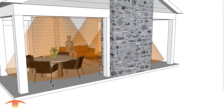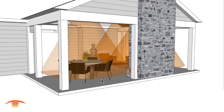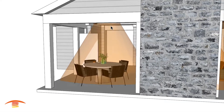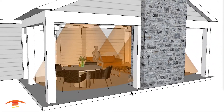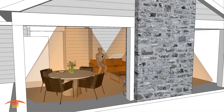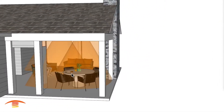The slab measures out to about 500 square feet, which called for about 7.4 units. But these are spot heaters — infrared light waves. Infrared is a light beam that warms the body. As long as you're in that ray you will feel the warmth; if you're outside of the ray you will not. There could be a little excess warmth coming off the floor after maybe 30 minutes of use, but it won't make you warm in an uncovered spot. Everywhere you are covered, that will be more than sufficient.